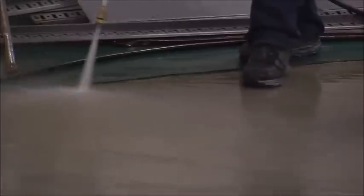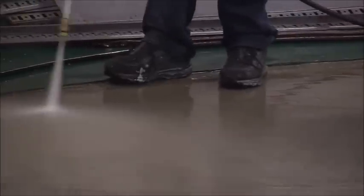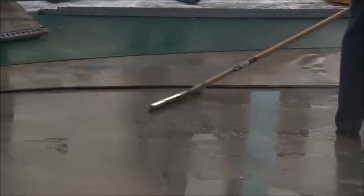When the fizzing stops, mop or hose off the solution and move on to the next section. When all sections are completed, rinse 3 times and scrub with a stiff bristle brush while rinsing. For best results, use a foam or rubber squeegee to remove the rinse water from the surface. A wet-dry vacuum can also be used to eliminate excess water, dirt, and contaminants. Do not leave pooled water on the floor.